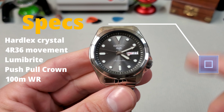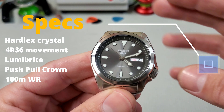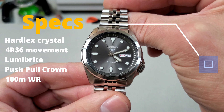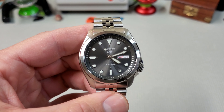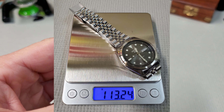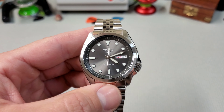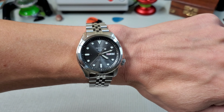Let's wind this thing up and see how it's running on the time grapher. It looks like it's settling in at about plus 10 — really not bad at all, especially for a brand-new watch just taken out of the box. I'm not sure it's fully wound; I put about 15 to 20 turns on it. But the amplitude is great for Seiko, beat error is almost nothing, and there's a real clean trace. I'm curious to see if it runs better on the wrist, but honestly I'm never gonna check that. Perfectly happy with the way this guy's running.